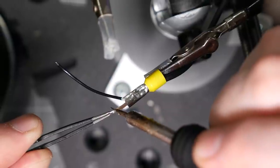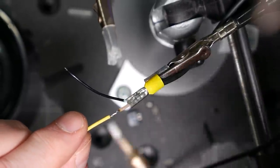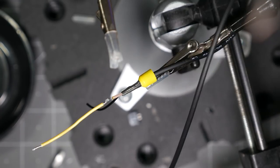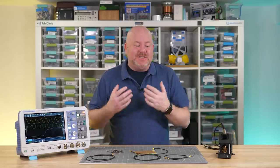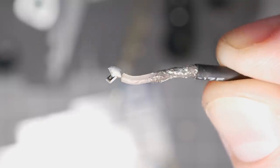Following Shabazz's example, I tried to solder the wires directly to the 0805 resistor. To make the joints a little stronger, I even tried using lead-free solder, which solidifies faster. However, even using this plastic stuff called Polydough, my tips would still break. Turns out, my soldering skills are just not up to the task. Here's one of my last attempts at the direct solder method.